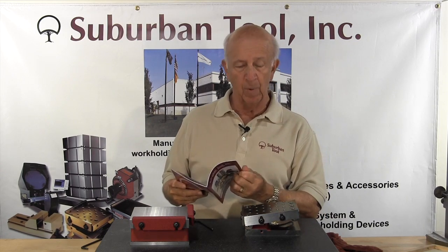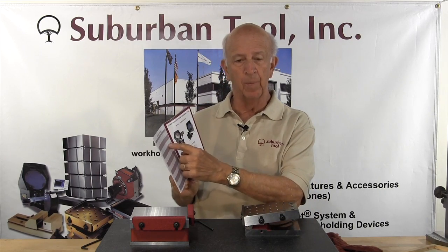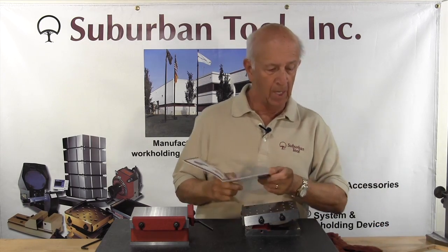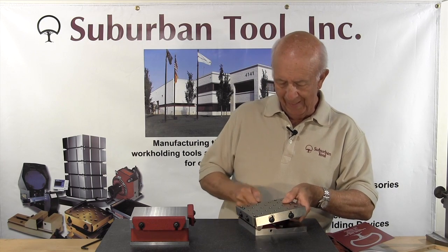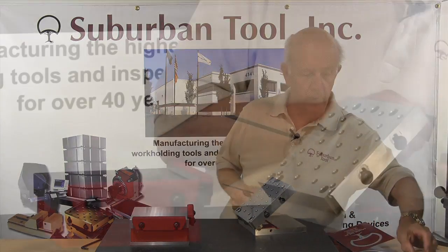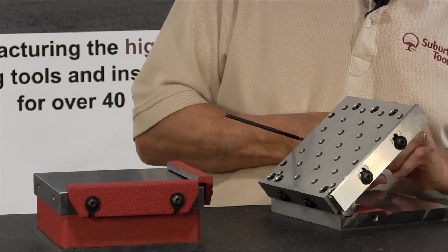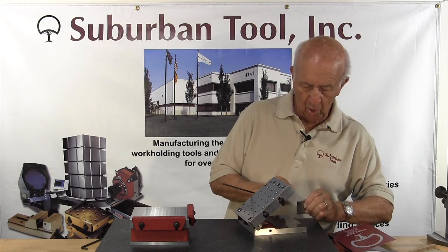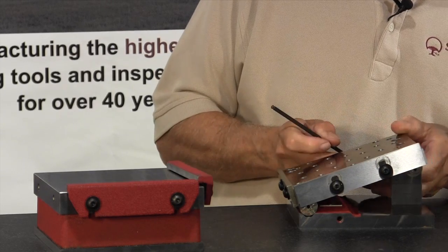Looking in the book, let's say we wanted 15 degrees, 10 minutes, and 12 seconds. Here it is — it says five inches. You find it here and pull the gauge blocks that you need. We're going to take the gauge blocks and ring them together like such. Set it down here, make sure you wipe everything good and clean. When you're working in close tolerances, everything has to be as clean as possible. You can't make it too clean.